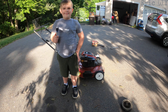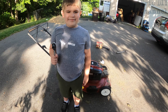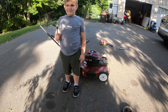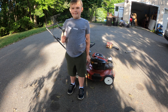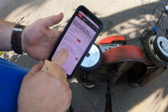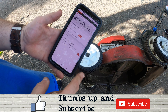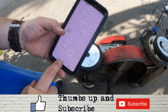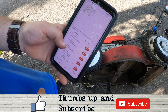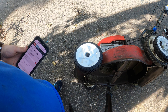If you're looking for the part number, it is 137-4832, and that's for an 18-inch wheel. You can buy them in quantities of two together — we'll leave a link in the description below. If you go to Toro's website, check your model number and your serial number, which is found underneath the rear door, you can find all the parts you need there. The wheel is listed under the front parts and it gives you all the part numbers.